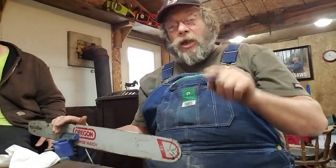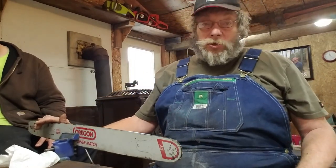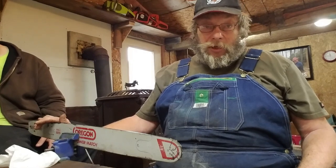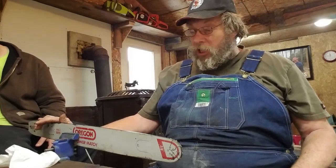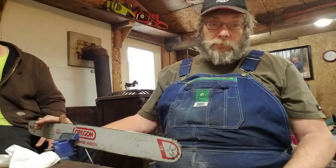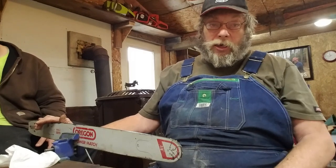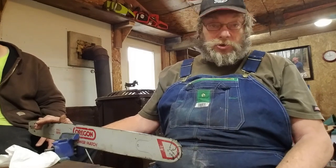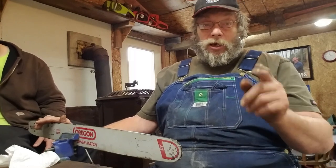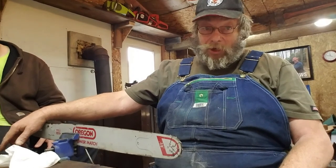I want you guys to grab your chain and pull that. If that don't glide, you're wrong. Loosen it up. Just plain do it. And you say, well, gee, Harv, I loosened it up and it didn't matter. Well, sucks to be you. Run it. Suffer. Just know the next chain you put on, throw another sprocket on because you screwed that one up too. Oh, you're going to argue that point too. I know what I'm talking about, guys. I argued all these points when I was young.